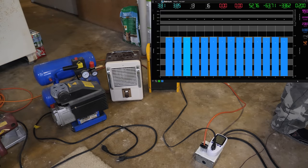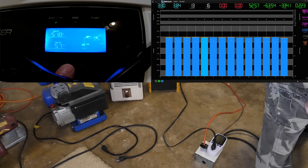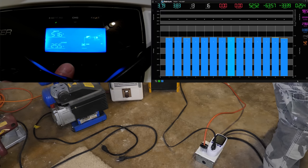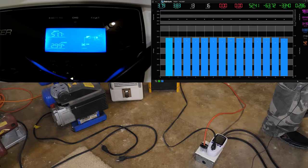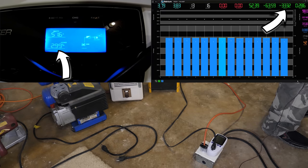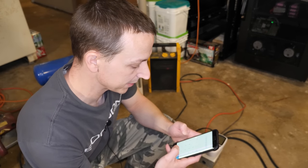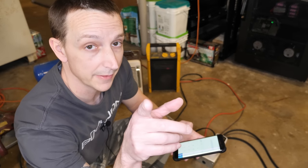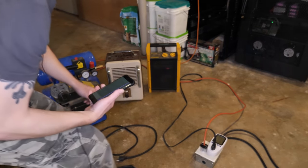Plugging in the second heater — the Batrium now shows 63.5 amps for a total of 3350 watts. The inverter is showing a 25.5% load and drawing 58 amps. The inverter display shows roughly 3000 watts. Quick efficiency test: 3 divided by 3.3 equals about 90% — not too bad. The manual shows 88%, so that's pretty good.